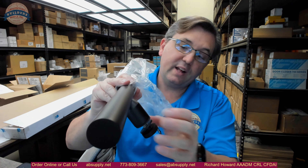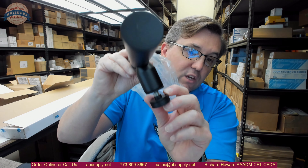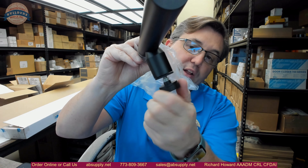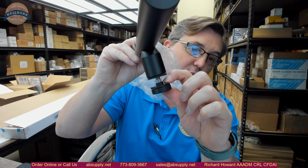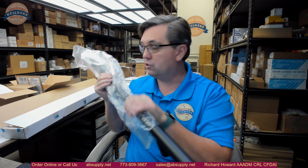You require two holes that are five-eighths of an inch in diameter. That will allow you to get your bushing and cap into that hole — the threaded part of the cap will get into that five-eighths hole. You don't want the hole to be any larger than necessary, nor any smaller than necessary.